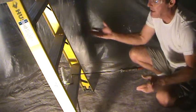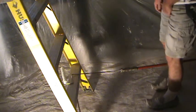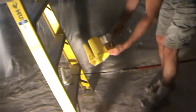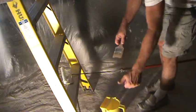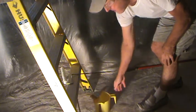It's best to go from the top down, especially on these cathedral ceilings. I don't want to go halfway down and do all the high stuff first and then come from the bottom up. Then it's hard to blend in and to manage how thick your paint is and all that. But I'm doing flat paint, so I should be fine one way or another. But before I do the mini roller, yes, I'm going to use this again to do all my cutting with just a crummy little throwaway paintbrush, because I've got to cut in the walls after.